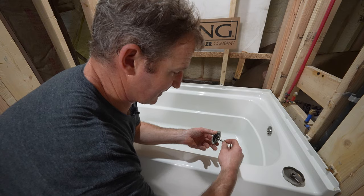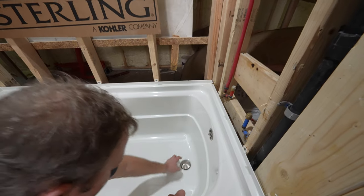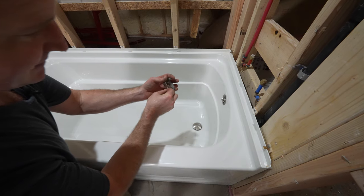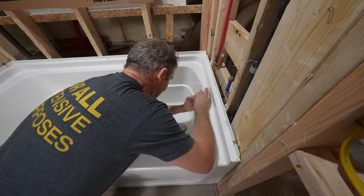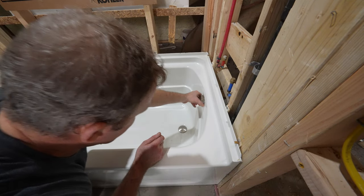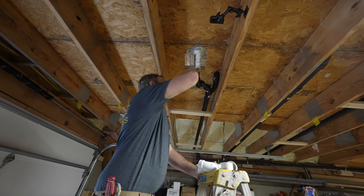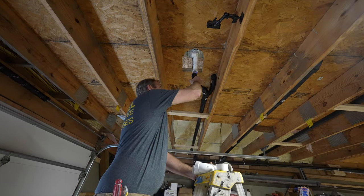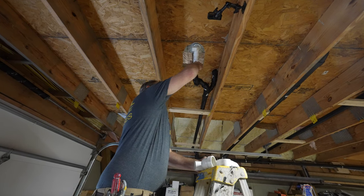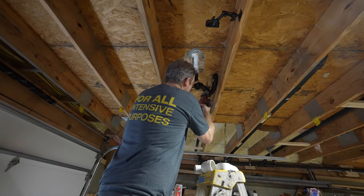This drain has a little set screw that allows you to adjust the height. It just kind of slides into the drain, and then this will adjust the height of how much it needs to pop up. This has a little set screw on it. This is very close to where I need it, but it's going to be very difficult. There is a little bit of flex in my line here, so I'm just going to make it easier on myself and change out the trap itself. This is PVC and that's ABS, so we're going to have to use some transition cement to change it. Let's go ahead and cut the trap off.